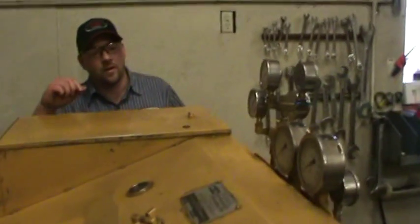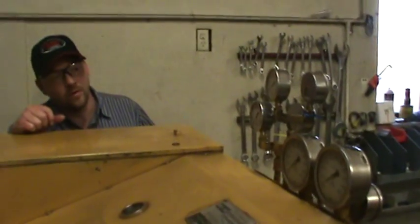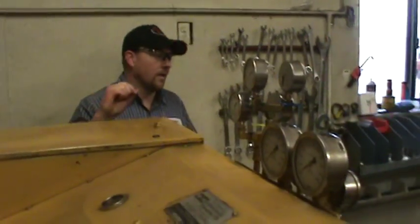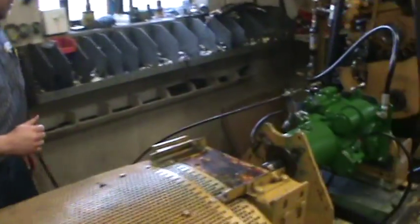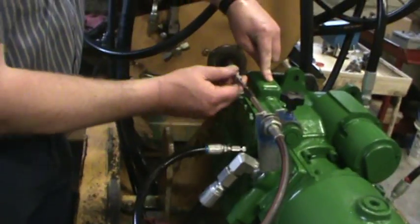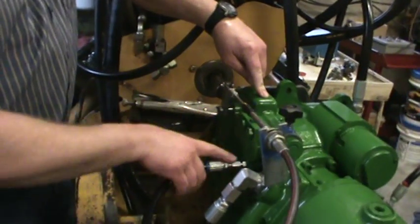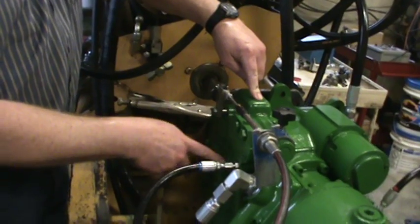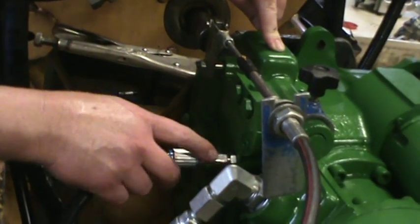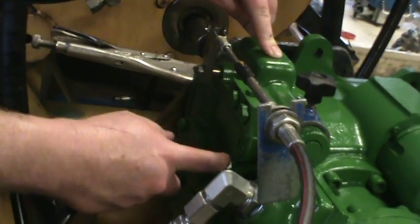As you can see, we hit 5,800 pounds or a little over, and we also had 250 charge pressure. If you need to check the charge pressure on your machine, it's right here next to the controller — I've got my control cable here — it's going to be the one next to the trunnion, but right next to your controller. It's not the flat-faced one.